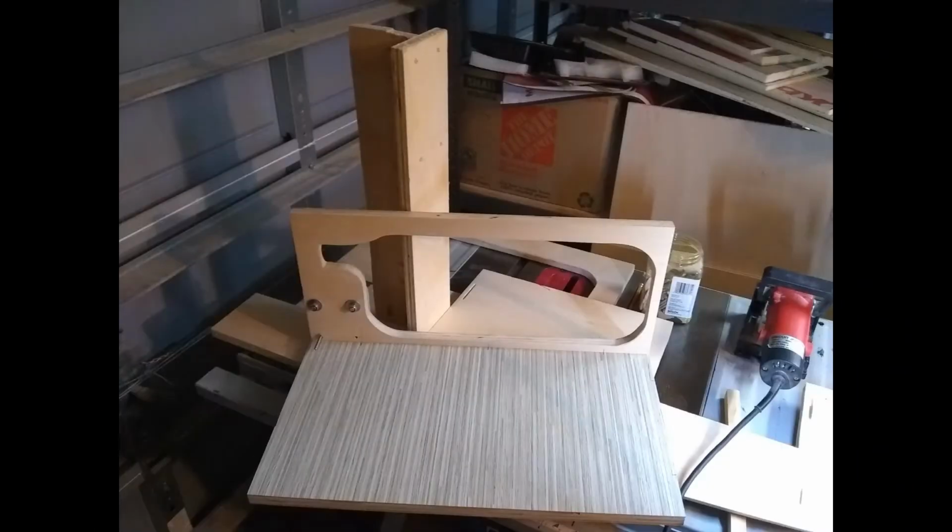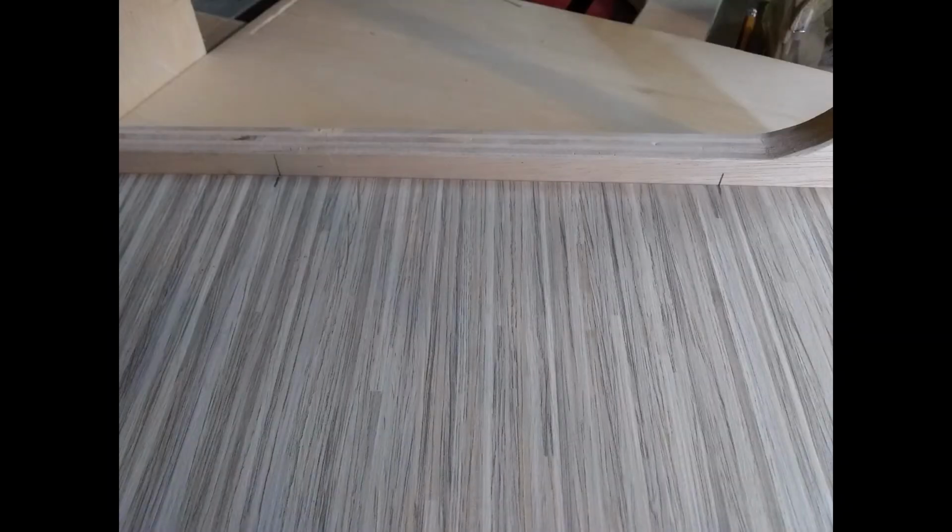van. Here you can see how the lower shelf would look with the front face on it, looking from the inside, with the bolts there that are going to hold the Lagoon table mount on the outside of it. To strengthen the assembly, I was going to use biscuit joints when I glued up everything. So that just means before you cut the biscuits, you want to line everything up and put some little marks where your center line is going to be for each one of the biscuits that you cut.